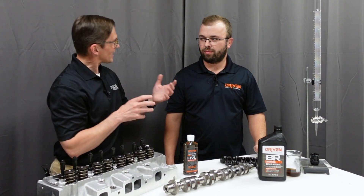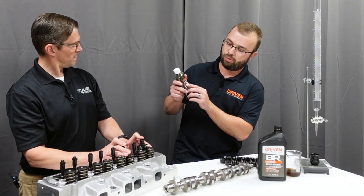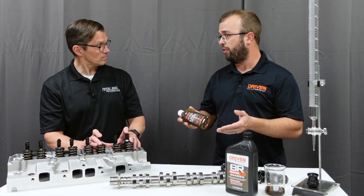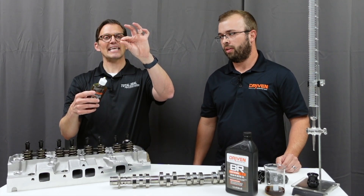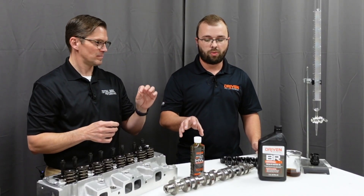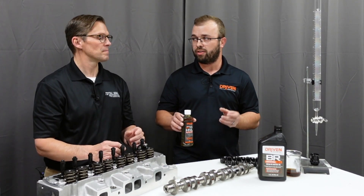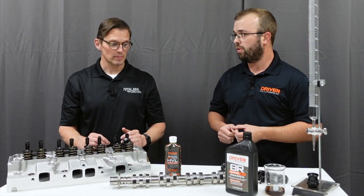We've made some cool updates, and one thing is the updates we've made to the HVL. You might notice this new little GP1 on it. We've updated it with the Pennsylvania grade base oil. So unlike other assembly lubes that are using a tackifier to make it sticky, we're actually doing that with the base oil. You can see the string all the way in between — it is tacky. Before, we had to add tackifier, which is not really a natural approach. By using the base oil, you now have an assembly lube that has that tack and that cling. It's going to stay put.